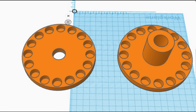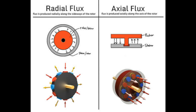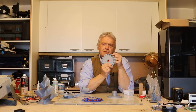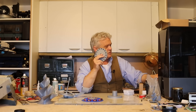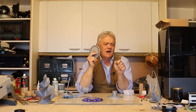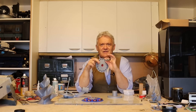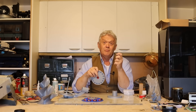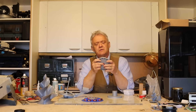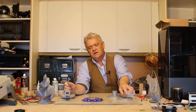The next things are the generator discs. It's going to be an axial flux coreless generator, so we have two magnetic discs facing each other. Each has a hole that will take a 15 millimeter circular neodymium magnet - I've got a whole bunch of them. They are 4.5 millimeters deep, the hole is 10 millimeters deep, and they go in north-south-north-south on both discs. There's also a skater bearing in the center, 22mm by 8mm by 7mm, which slides on the metal bar.